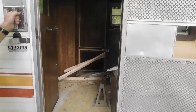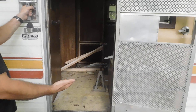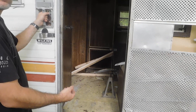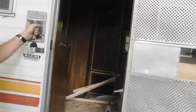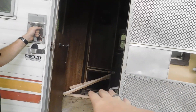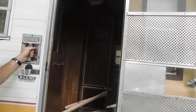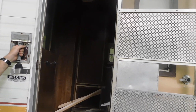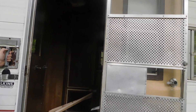Possibly underneath as well, unless I make a skirting — two by fours with rock wool all underneath. I would do that anyway, because even if you put skirting on it, when you get up in the morning the floor's not going to be ice cold if you have that extra insulation underneath. Like right now, our floors — I haven't finished the floors in there and it's just the plywood — they're warm as can be in the wintertime.